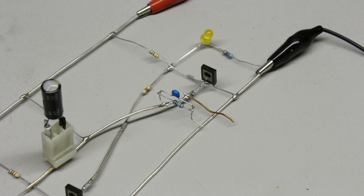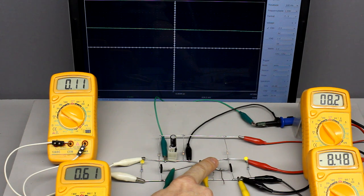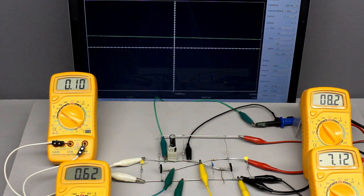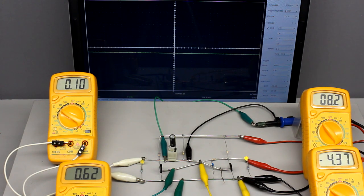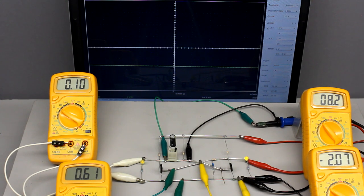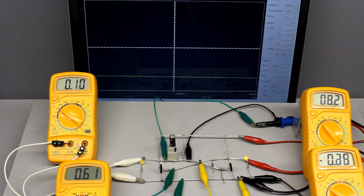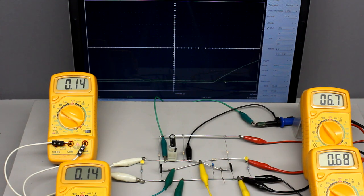The circuit can be altered with another capacitor-resistor network to get just a small pulse while actuating the push button. By pushing the button, capacitor 2 is switched in parallel to the base of transistor 2, hence the voltage drops to 0 because capacitor 2 was discharged beforehand. As long as the button is pushed, capacitor 2 gets charged via R2 and capacitor 1. The lower the capacitance of capacitor 2 — it must be clearly lower than that of capacitor 1 — the faster the charging and so the higher the voltage after a very short time, resulting in a short turn-off time of transistor 2. When the button is released, capacitor 2 gets discharged via R6, whose resistance should be clearly higher than R2. So the initial state of capacitor 2 is reached, and the turn-on time of output Q is independent from how long the push button was actuated.